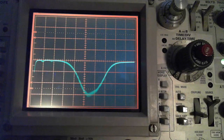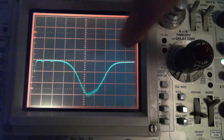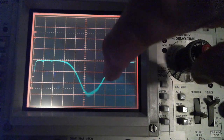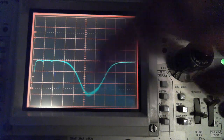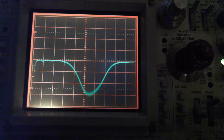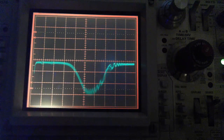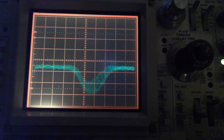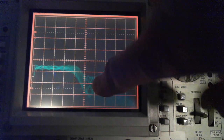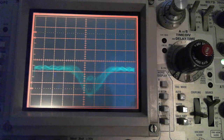So, in a more ideal arrangement, there's basically a pip that'll travel down here. And the pip is based on the frequency of another signal generator, and if you know the frequency, you know what frequency the pip's at. In my case, the way I'm doing this, you can tell when you've got one signal generator on top of the other, or on top of this curve, because of the weird things that happen. Let's just do it here. See it kind of coming down from the right? So what I've done is I've marked this position with the other signal generator.